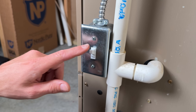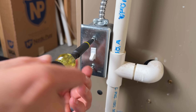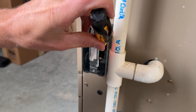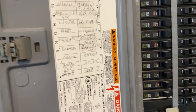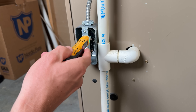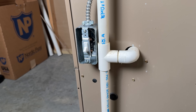You should have a light switch right on your furnace — turn that to the off position. I'm going to remove this cover and confirm with a non-contact voltage tester that we are still seeing power there — you'll see the red LED at the line side coming from the circuit. We want that off, so go out to your circuit breaker panel. Position number eight is the furnace for me. I'll flip that off and then confirm with the same non-contact voltage tester that we do not have power.